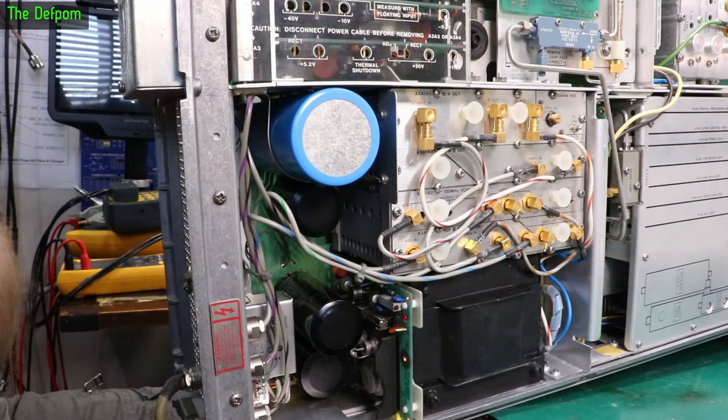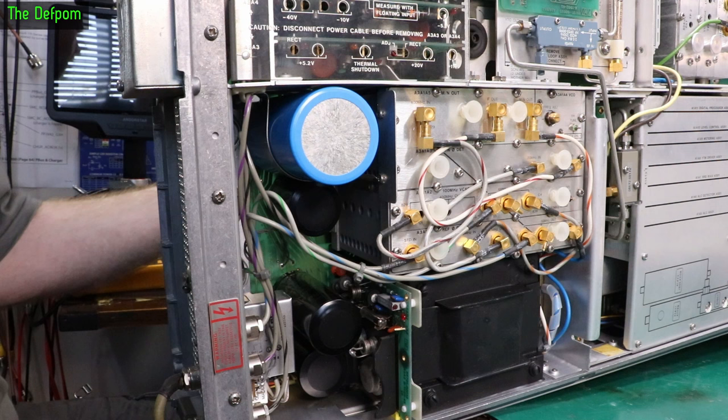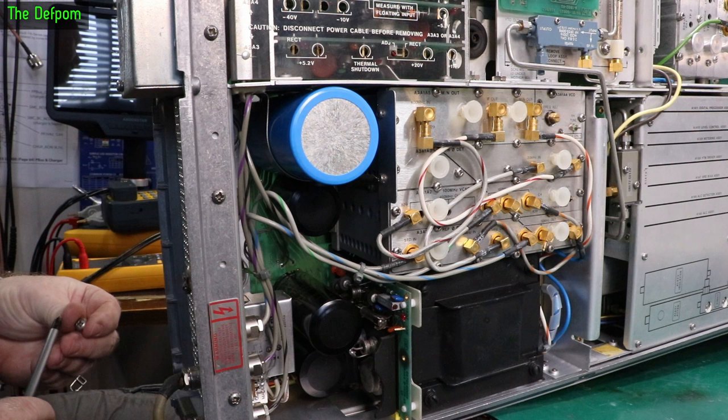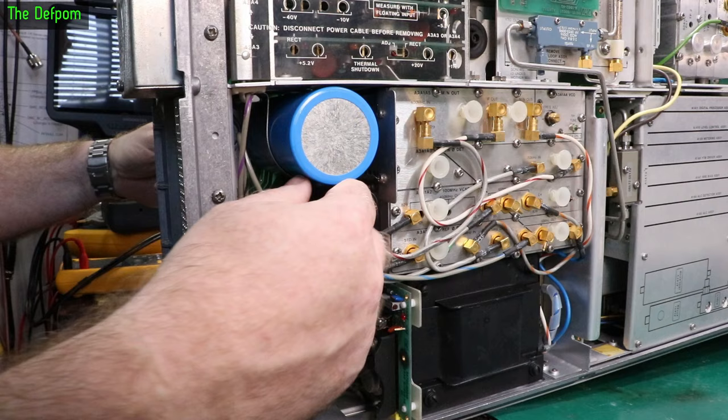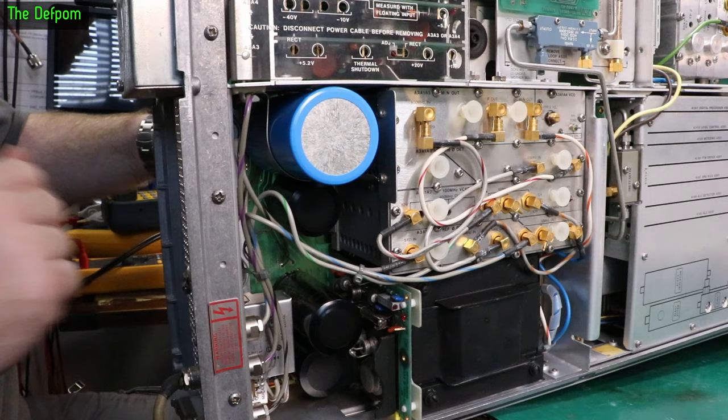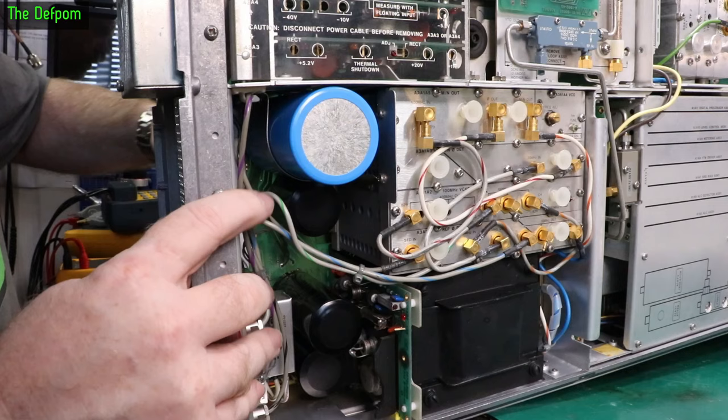These caps I've taken out — if you'd had this powered up recently you'd probably want to discharge them before touching them. Particularly the 75V one you'd want to discharge. But this hasn't been powered up for months so they'll definitely be discharged. If it's something you've just been working on and powered up recently, you want to be careful — you don't want to accidentally zap yourself touching terminals that have power left in them. Capacitors store charge for quite a long time — certainly minutes, hours, sometimes days.